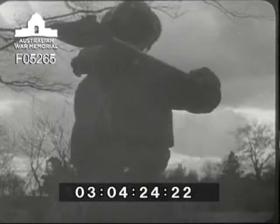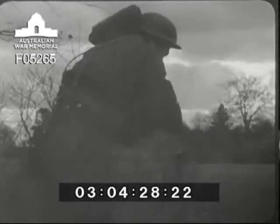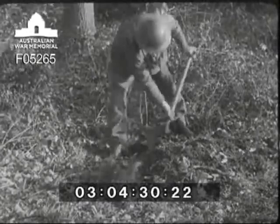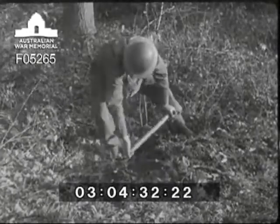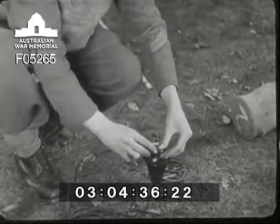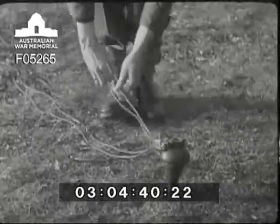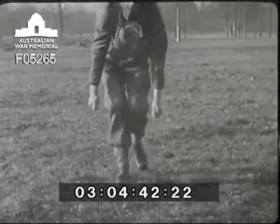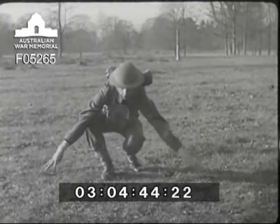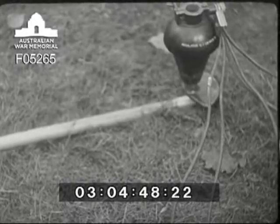The driver has finished his camouflage. Normally he would be laying out the remote control line, but with danger of air attack, he starts digging the slit trench where the set will be placed in safety under cover. Operator one is connecting the spade of the counterpoise to the insulator. This gives it a firm anchor when he's fanning the leads out. The butt end of the mast is pushed against the spike to steady it when lifting.